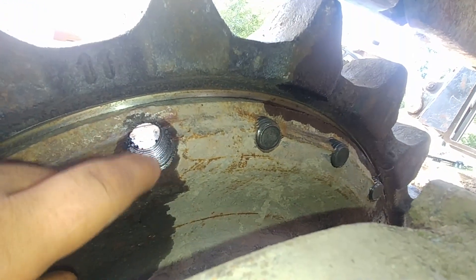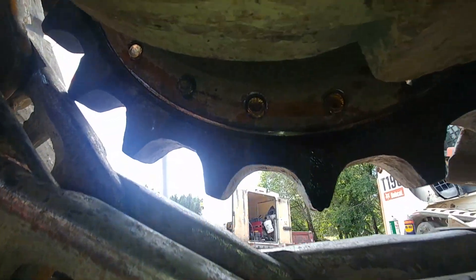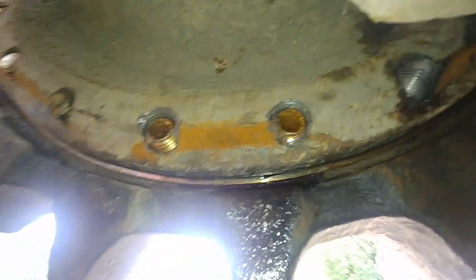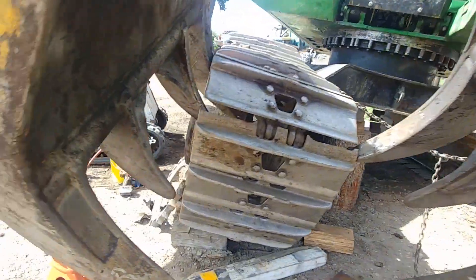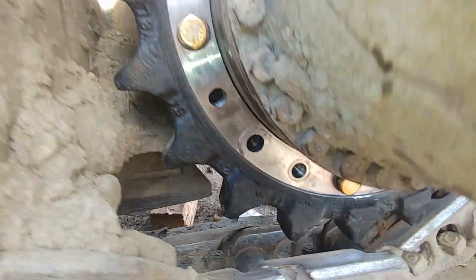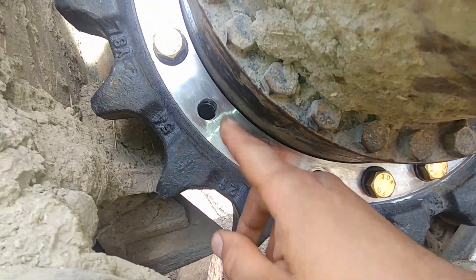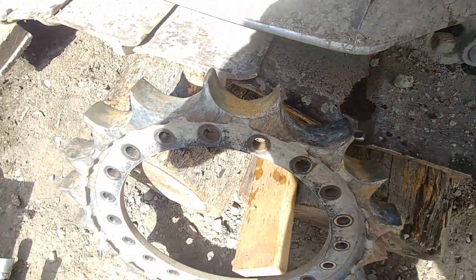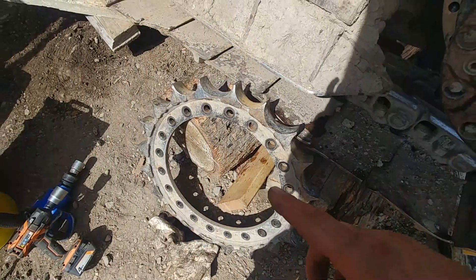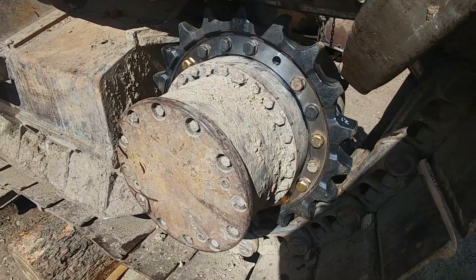In five to six hours I can do both sides on the excavator. By the way, this is a John Deere 2154D logger hydraulic road builder excavator, and this sprocket should last at least seven to ten thousand hours. Make sure to re-thread all holes and torque everything to spec — quality is first, and yeah, time is most important too.